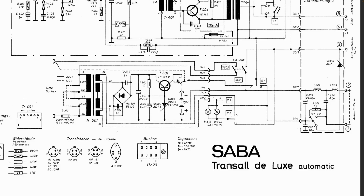No, increase. So that'll be not 0.7, sorry, 0.2 or 0.3, depending on the AC117. But if that's 7.5, that'll be, say, 7.7 or 7.6. And that's the voltage that becomes your ground. So between that point and that point will be your 7.5 volts, okay? And the difference in voltage is dissipated across the collector-emitter junction of this transistor. Now, that leg there was completely gone, and what they've done is they've taken this leg here and that one, and just wired it directly to that point there. It's just amazing. Really amazing.